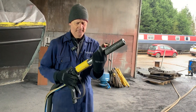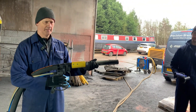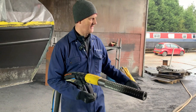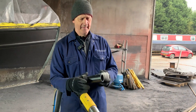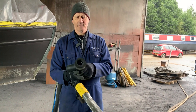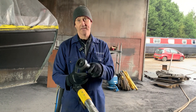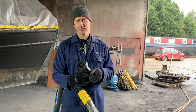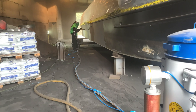With the new gun it's a lot easier to use, putting the operator in a really good position to blast. On top of that, we can also do vacuum blasting, which is becoming more popular for hard-to-reach areas and areas where you don't want any dust. A vacuum head is fitted where the abrasive is drawn back up and recycled through the machine, so there is absolutely no dust at all. For internal areas such as tanks and engine rooms, this is a very useful option.